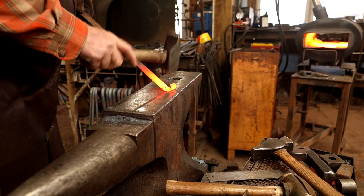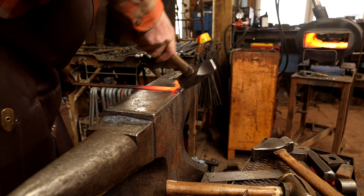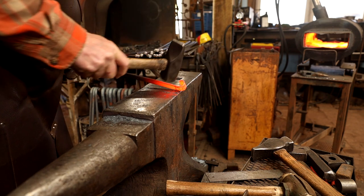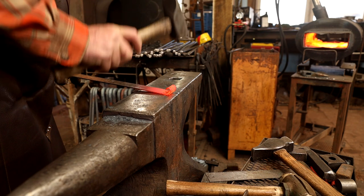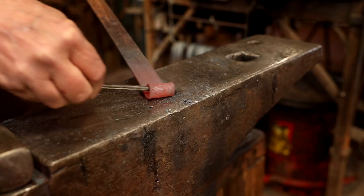This eye starts just like any other hinge eye. I prefer to start at the edge of the anvil and wrap it up as much as I can by eye before I put the pin in, and then I size it to the pin. If this takes several heats, just go ahead and take several heats.